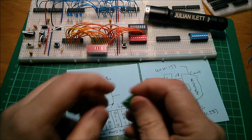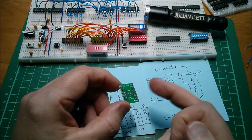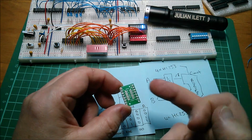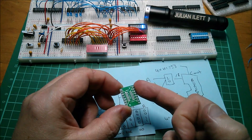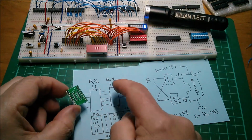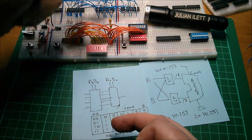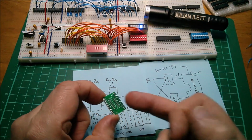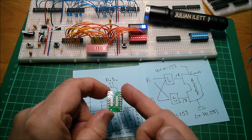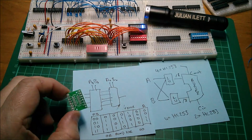And it did occur to me, because you've got to parallel all these inputs up across all 8 units, that actually you could have these little chips, they're 16-pin chips, stacked vertically on these little boards using surface mount. Probably not that one, it would be better using long pin stackable headers, and you'd simply stack these up to bus these chips in a vertical arrangement. Now, if you're going to bus these, all of these latch chips here will be bussed. Why not bus them vertically as well on 20-pin little surface mount breakout boards like this? Part of this computer could be built vertically.